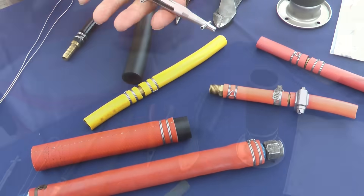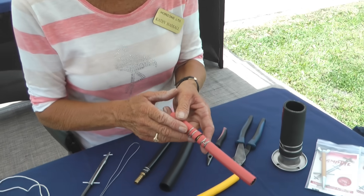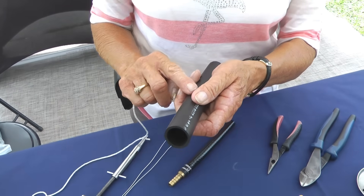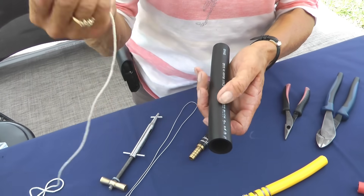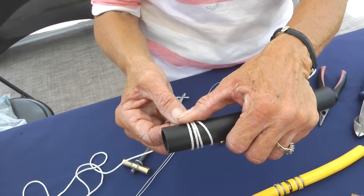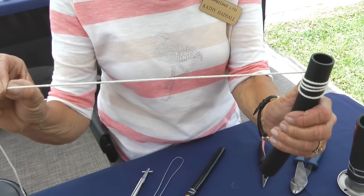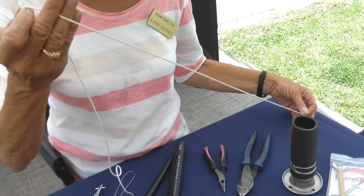These are a few examples. Because this is a one-size-fits-all, we need to know how much wire you need. The directions say to go two times around whatever you're clamping and add 12 inches. I use a piece of string — four times around whatever I'm clamping — and then always add 12 inches, which is the amount of wire needed to hook up to the tool. Then I use that as my guide to pull wire out of the can.